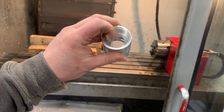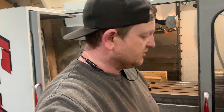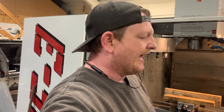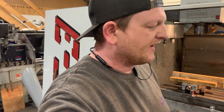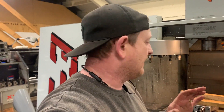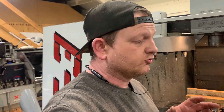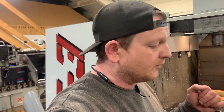I noticed that doing these parts, for example, it had to go down and bore out this pocket. When the end mill went in - I was using a 16mm end mill, probably got it here, this one - when it went into the bore and started roughing it out, the noise was pretty bad, it was squealing and screaming. It doesn't do that on the VF0e. It can be a little bit noisy in aluminium if you haven't got great chip evacuation and the coolant's not getting right in there, but it just sounded rough. Also when it was drilling, something didn't sound normal.